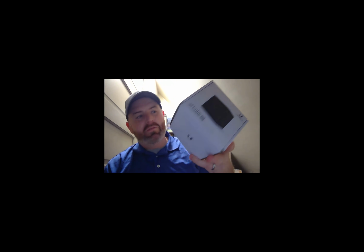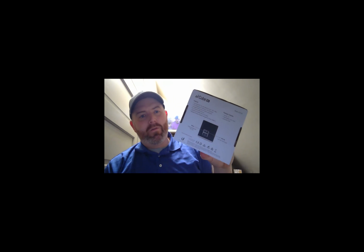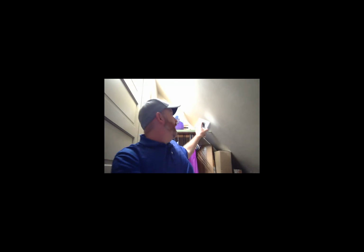The reason I say that, and not to promote another product, is that there's a number of products out there that actually power these devices already. Some of you have tested it. I actually have one behind me that I've tested because I want to do an interop. I'll pull it up, even though I'll probably get smacked later. That's the new Ubiquiti AirCube. Some of you guys have got it. Snuck this one off the beta store. This one does 24 volt PoE out, and it actually powers all of our outdoor UE.